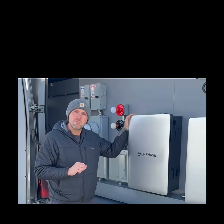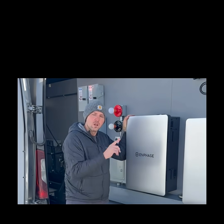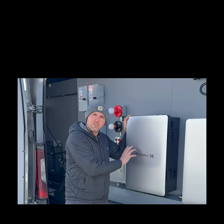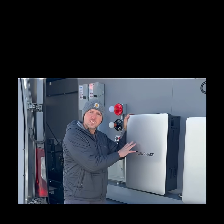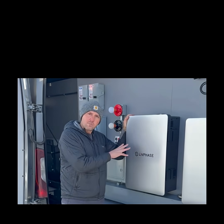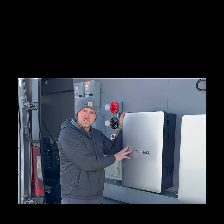There are two main reasons why you must torque all the terminals when you're landing the wires into this unit. Number one is for safety — we want to make sure that we don't create any thermal events on those terminals. We also don't want any loose wires potentially coming out and touching anything, causing an arc event inside. The second reason is it's our requirement that everything is torqued correctly for proper operation of this unit.